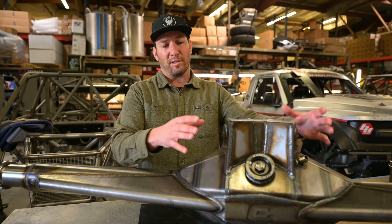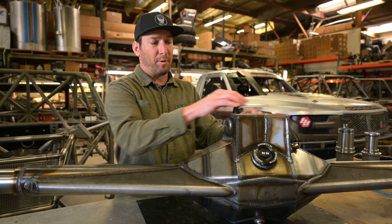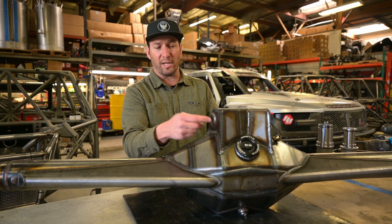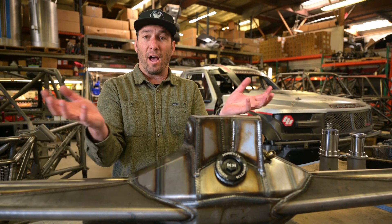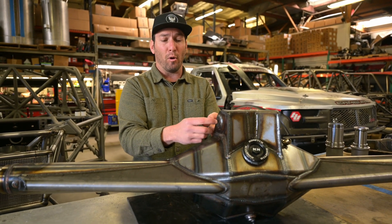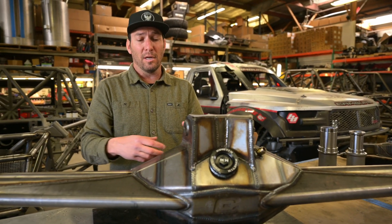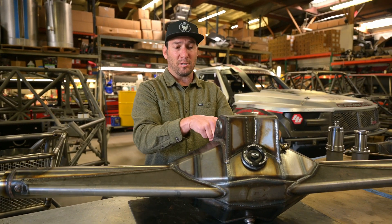This is a four-link we're in. When we construct the four-link tower here, it has all these different plates with different gussets. We also weld washers on the outside of both tabs, so when the bolt, nut, and washer go on there, it doubles up the thickness of the material and adds a lot more surface area under the bolt. That prevents a lot of ovaling out of the holes if your hardware ever comes loose. These are all gusseted up here as well as internally gusseted behind.